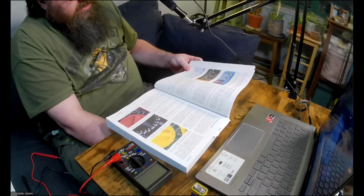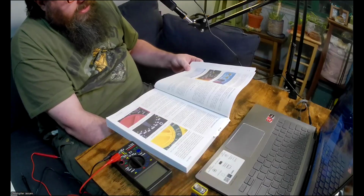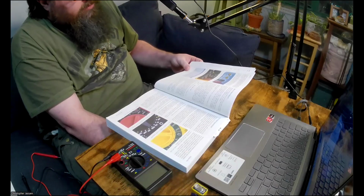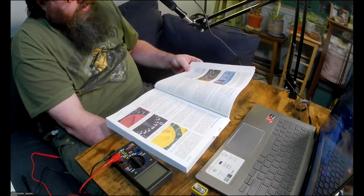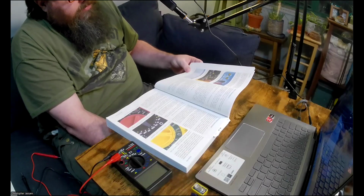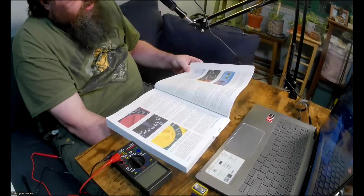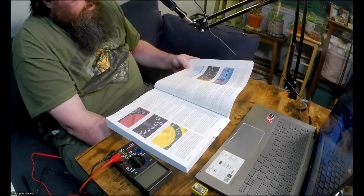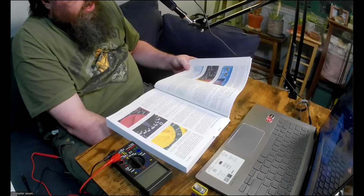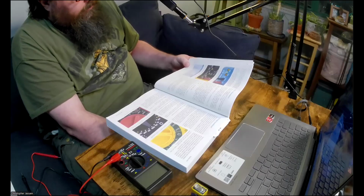In Europe, you may find that a resistance value has a letter R, K, or M, where you would expect a decimal point to be. This reduces the risk of errors because sometimes a point can disappear when it is badly printed. Thus, 5K6 in a European circuit diagram means 5.6 kilo ohms, and 6M8 means 6.8 mega ohms. And 3R3 means 3.3 ohms. I won't be using the European style here, but you may run into it in some circuit diagrams elsewhere.